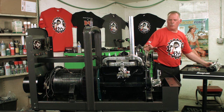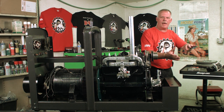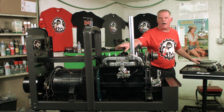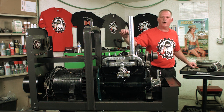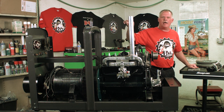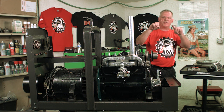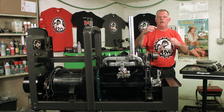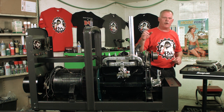Okay, so when you're in that position, what you're going to see once you have your Magneto in place and anchored down is when you look in the window that is behind your oil bath, you'll see a window back there. It's got a little striker indicator in there. If it's an F-163 blackface or whatever, it'll have an hourglass looking piece in there, and the center of your hourglass is going to be where your timing marks need to be at. If it's a red face or whatever, it'll have a round window with a little strike indicator on the inside.